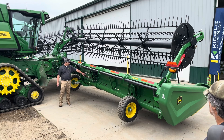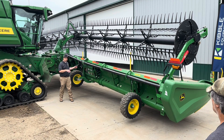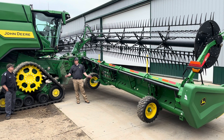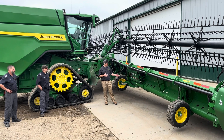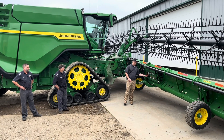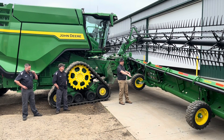Each wing is independent. When putting this on a header trailer, the decals can be a little confusing, but push the solenoid in and go counterclockwise — that prevents pressure buildup. As the sun hits those cylinders and builds pressure, it won't cause the wing to work up off the trailer. When you hook back up, make sure your straps are undone, then come to each wing and close it clockwise — it's just a relief valve.